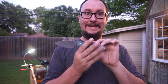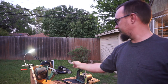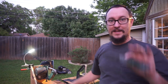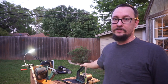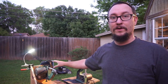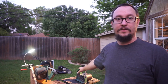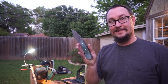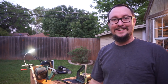We're going to focus on getting these handle scales shaped, and we're actually going to be doing it on some 1x30s. These two right here — we're going to be using those to shape the handle scales. You could definitely do this if you have one of these tools. These are just 1x30s and all we're going to be working with is 80 grit belts. Same belt on both little 1x30s. Let's get to shaping — I'll break it down, tell you why I'm doing things, and we'll get it done.